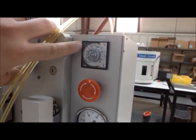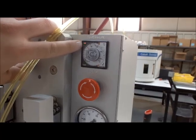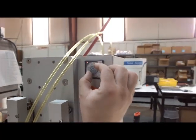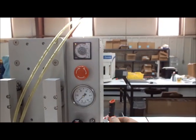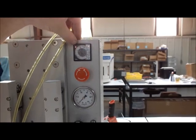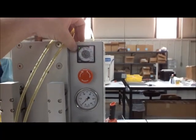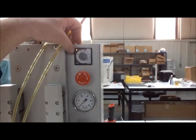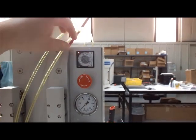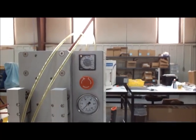As the temperature drops below the set point, the output comes on and it just keeps it hovering right around the set point. If I increase the temperature to 80, for example, you can see the output comes on again. It's going to warm it up to 80 Celsius — right there it reached it, right there it overshot by just a little bit, and then it'll settle back down. That's how it keeps it at temperature.